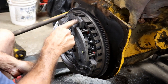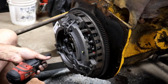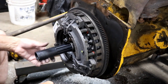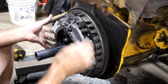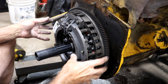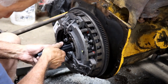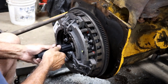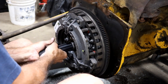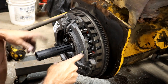This is something you definitely want to make sure you've got good and tight because it's inside the tractor and you only get one shot at it. If these things come loose, you're tearing the whole tractor apart again. So I'm going to find the torque specs and make sure I've got them torqued to the proper specs. I haven't torqued these bolts down yet. I know I need to remove these hold-downs — this is what keeps the springs compressed until you get this all tightened up.